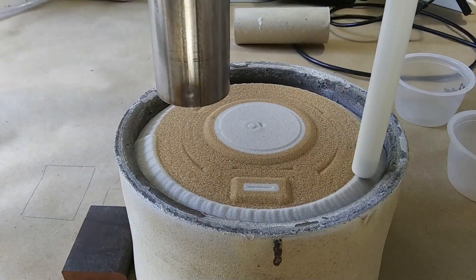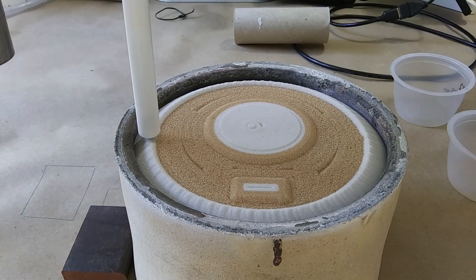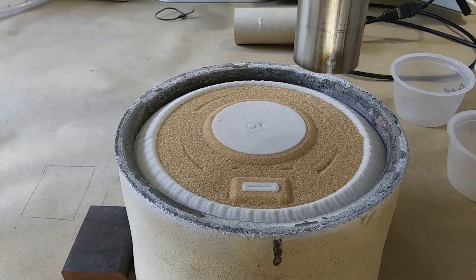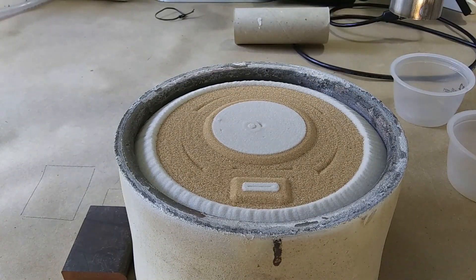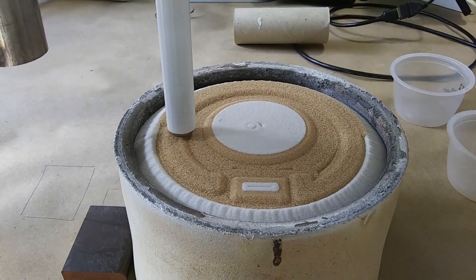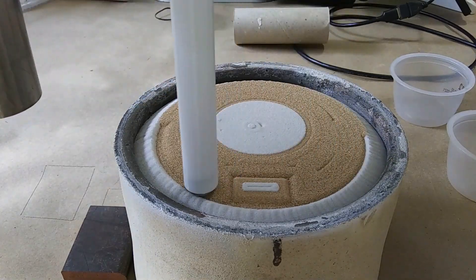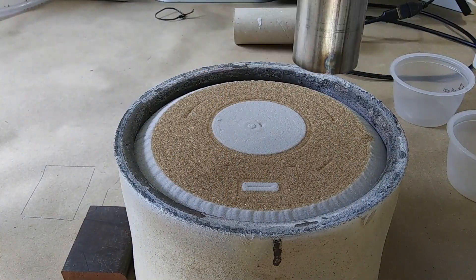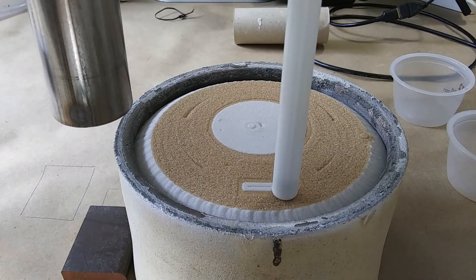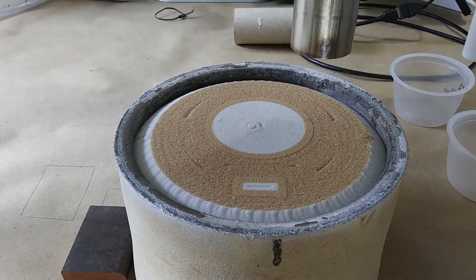In essence this process is very similar to 3D printing with glass powder, but instead of glass powder we use shell sand and bake it at about 180 degrees Celsius rather than 750. So basically as usual we deposit build powder — which is shell sand in our case — and support powder, which is regular sand, and bake it at about 180 degrees.